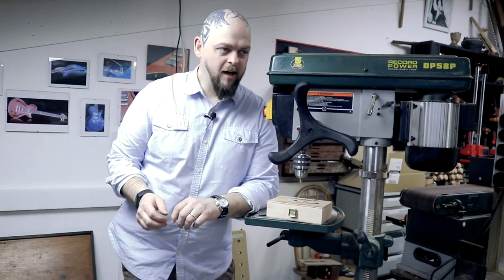Okay, let's very quickly, essential tools for guitar building. There are some things that you just can't do it without, like everything that Crimson makes. Of course, leveling file or a fret leveling beam. I wouldn't do it without a notch straight edge. I wouldn't ever want to do it without a fret rocker, for example. So there's some specialist things like that you have to have. But one or two hand planes, as I said earlier, a jointer, a number three or four, and a block plane are pretty much essential. You need one or two chisels, you will need one or two gouges, you'll need screwdrivers and rulers and protractors, and I wouldn't want to do it without a vernier gauge, for example.